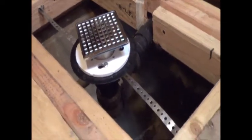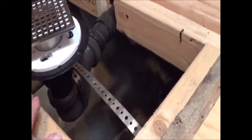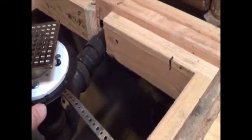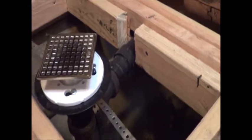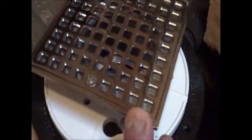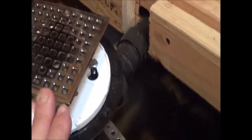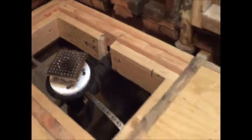Then we're going to mortar on top again with a second load of mortar. And then we're going to screw this down and get this positioned to a height and bring the mortar to it. And the last thing we'll do, you can see two screws here, is we'll screw this back on at the proper level, and then we'll put our finished tile on. So we're going to have to make some measurements.